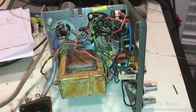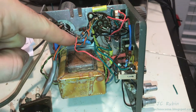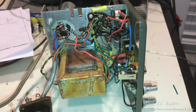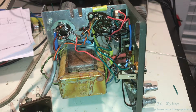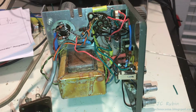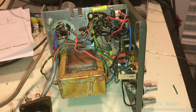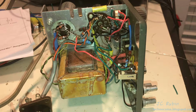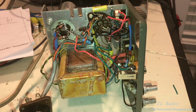They're not balanced, but the voltage drop given the resistor here that I had replaced shows it to be on pin 1, 98 volts, pin 6, 83 volts, and that's up from 77 and 61 respectively, with a bias change to 0.78 and 0.87 from 0.5 and 0.6. This thing is floating in normal operating territory, be it low end, but it went from deplorable to acceptable, right?